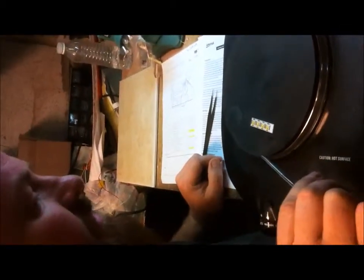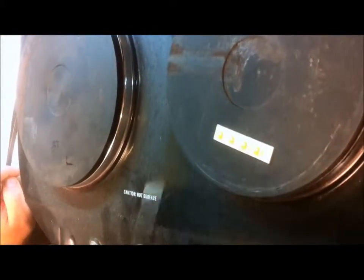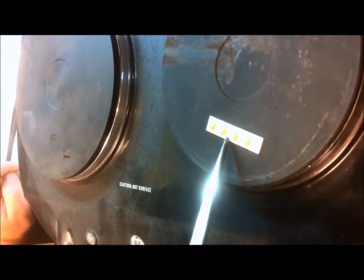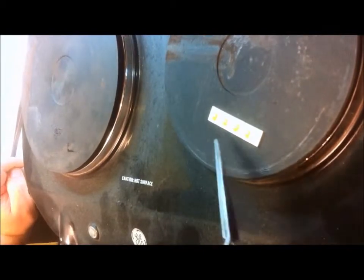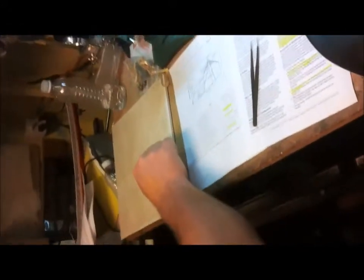It's been less than 60 seconds, but I can already see the solder turning shiny and starting to change color. I'm moving it over to the other side. When it gets good and hot, the LEDs will move slightly as the solder liquidizes. I can see wetting action going on below — I think we're about there. I take it off and place it on the ceramic, adding it into the water a little.